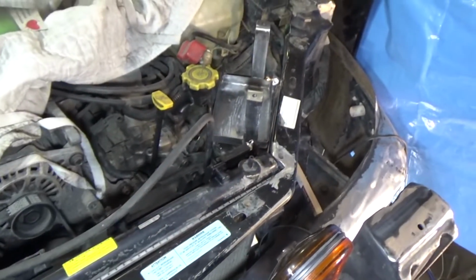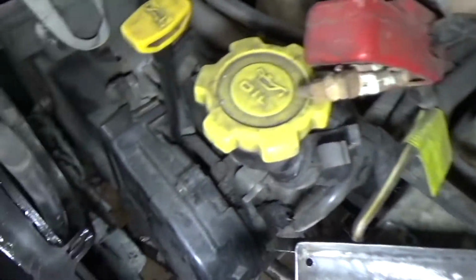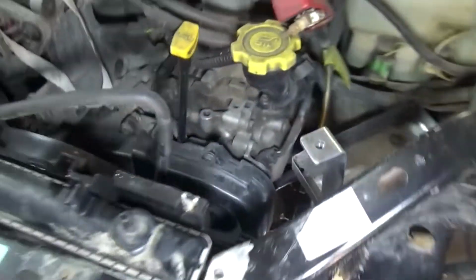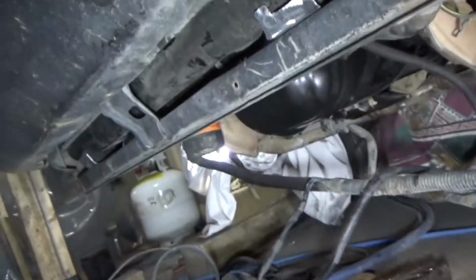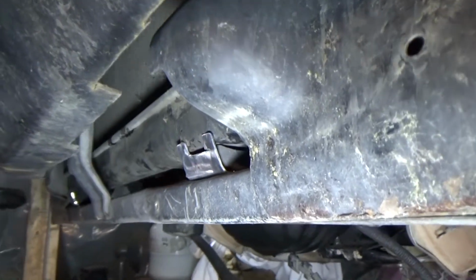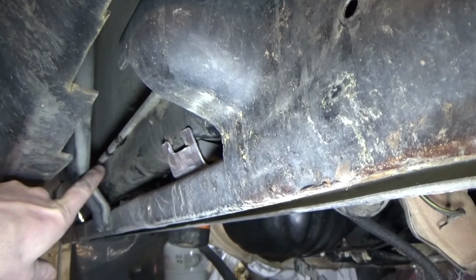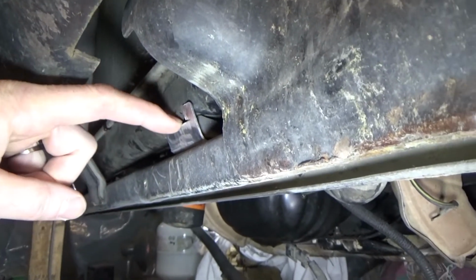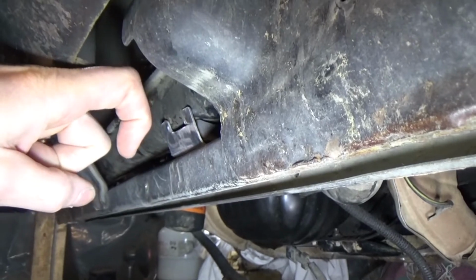Well, I'm just getting the radiator test fit here. I've got my mounts mocked up down there. They're not welded in place solidly yet, and I actually have to move them. So you can see where they are right there. They actually have to come ahead quite a bit. The radiator has to sit pretty well against that brace. So these have to move up about 3/4 of an inch, which means they'll be overhanging the edge like that.